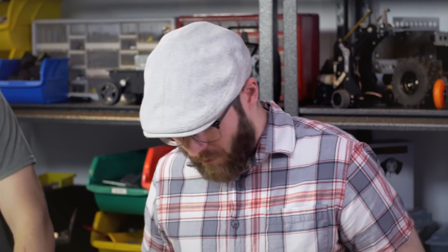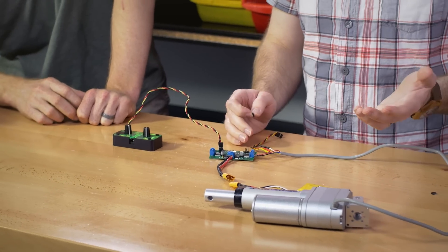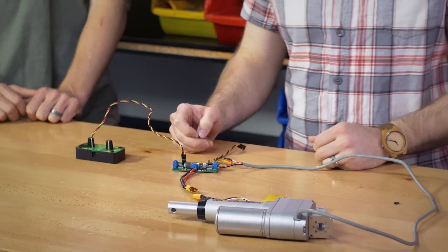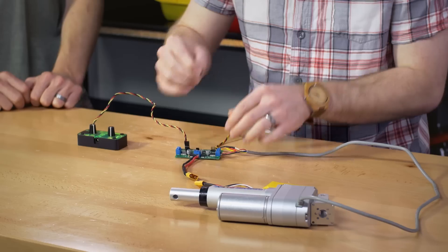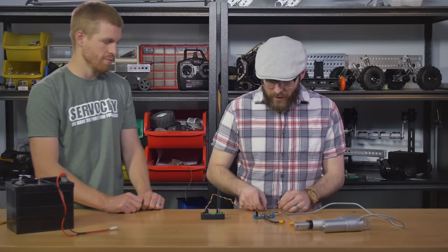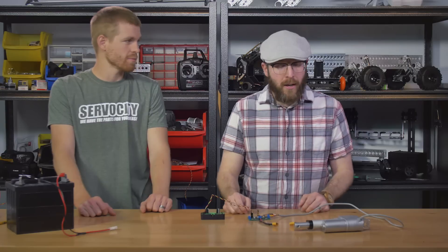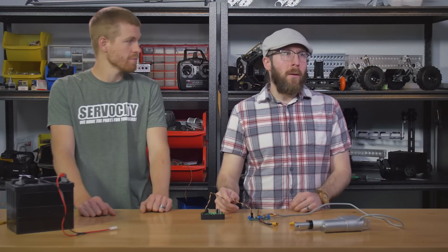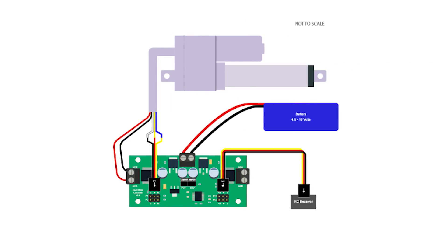Next, I wanted to show that if you utilize the other three wires that you have here, you could have feedback as to where the actuator is and control where you want it to be. To do that, I'm first going to add some jumpers to put this dual motor controller into mode four, which is position control mode. In that mode, it's going to be reading data from the pot — an analog input signal — and that'll tell the motor controller where the linear actuator is within its stroke. It's also going to be still listening to that PWM signal to determine where it should be, so it'll look at where it is and where it should be and move the linear actuator to adjust.